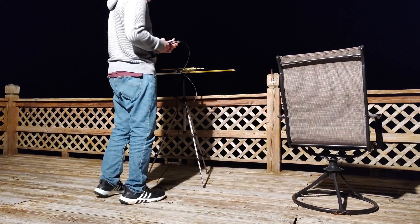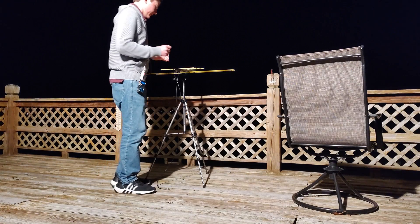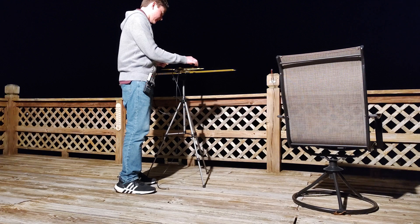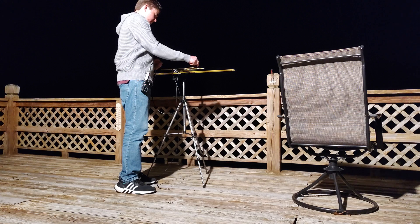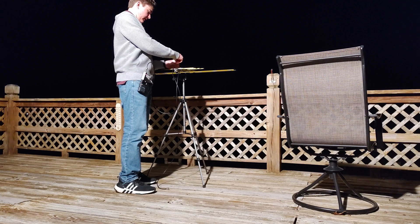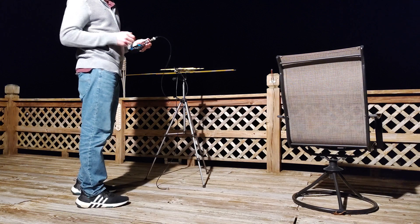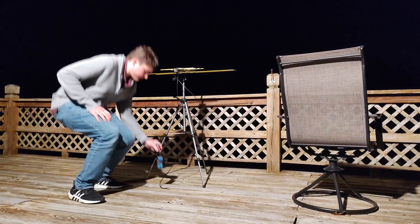After moving the elements many times I cannot get the SWR to fall. What we're going to do is get it resonant — it seems to be perfect on low power, so this is just going to be the receiving side anyway. I'm going to get about 3 to 1 SWR. If you have any ideas how to fix that, leave it down in the comments. On low power we get 1.01 to 1, so I guess we can run this one at low power. This is KC3TCK signing off.